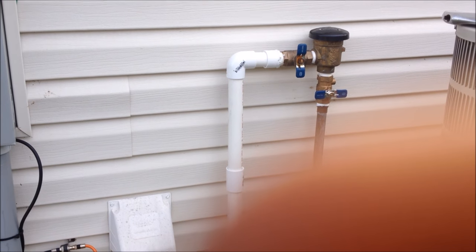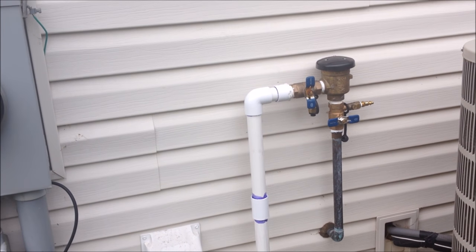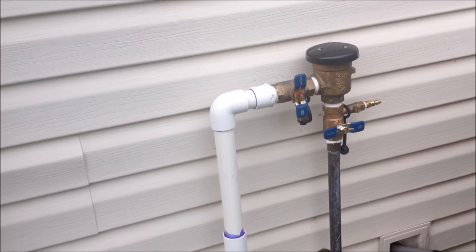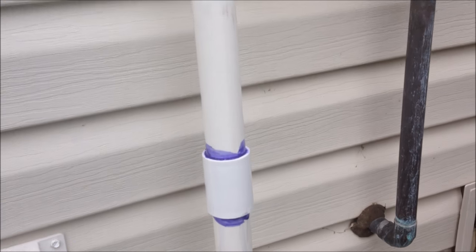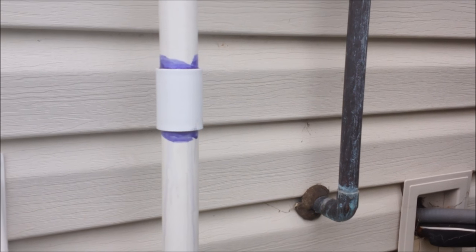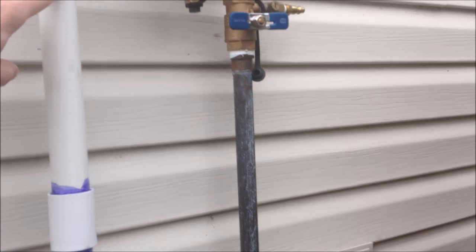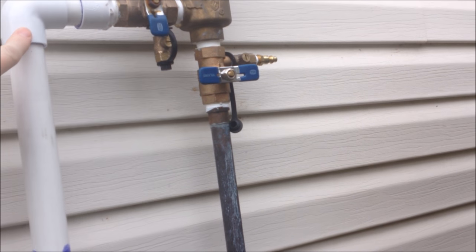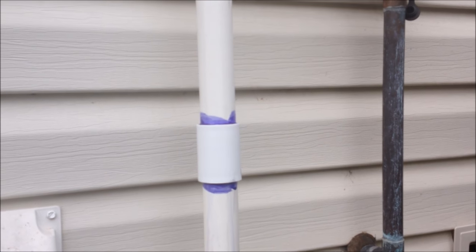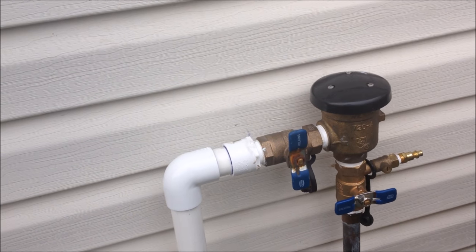Here's the final mockup. It did take me a couple cuts on the top pipe. Sorry for the cutoff of the last clip — I ran out of memory on my phone. Anyway, I basically went over how to prime and cement your connections. Just make sure that the pipes are clean and that you're getting an even coat of both primer and cement on both fittings — you're going to want to do your pipe and also the joint, on both surfaces. And obviously let it cure; if you don't do that and try to use it right away, it might not seal as well.